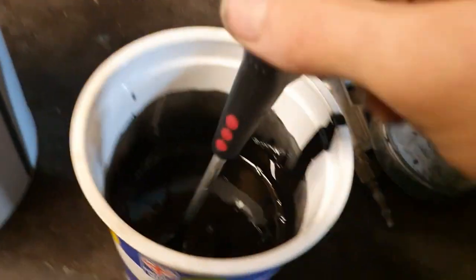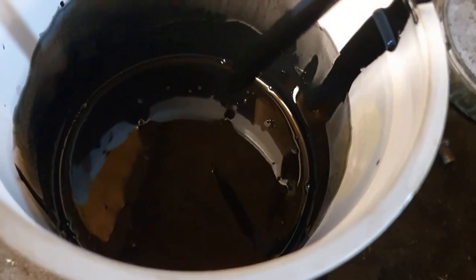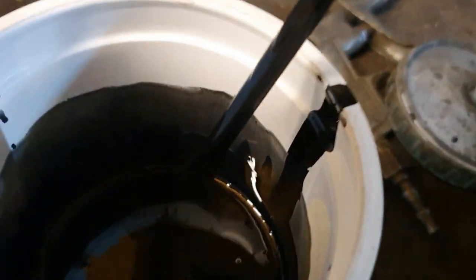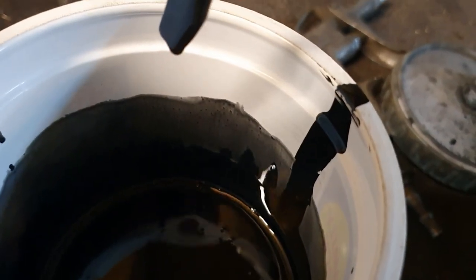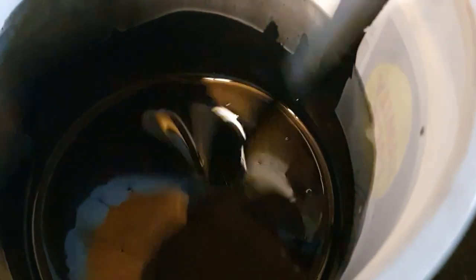I've got the Lotus hammer finish paint thinned down — it should be like single cream, so they say. It's hard to see how thick it is but there are a couple of gauges. You can see how thin it runs off the screwdriver — it's dripping already, so it's not too syrupy. The other gauge I like is how long it continues rotating — you can see the little bubbles still going, then stop — or just drag the screwdriver through it and you can see the movement.